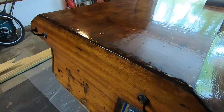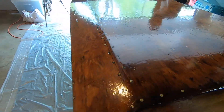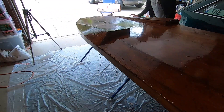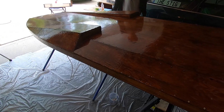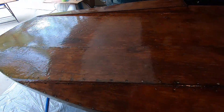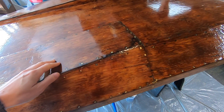It's curing — it's going to be 70 degrees today so if we could get this thing outside it'd probably get rock hard. But I'm wondering if it's soft enough to do more coats. Right here that looks like bare wood, and there are a bunch of cracks in the wood that still need epoxy — I think it needs another coat. You can only recoat if it's tacky; once it cures a certain amount it won't bond. I think it's still tacky enough.